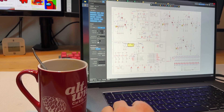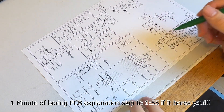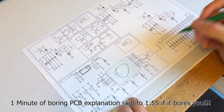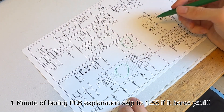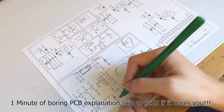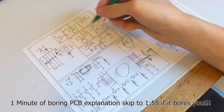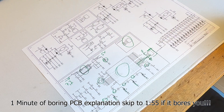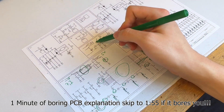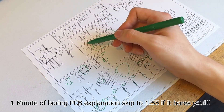It all started in Altium where I drew the schematics. They are separated into three pieces. The first one is the ATmega chip here, which powers the whole logic. Then of course a flashing connector, a trigger to power it, LEDs for each stage, the LDO to go from 7.2V of the batteries to a constant 5V, the reset button, the display, and the power button circuit — basically this one here — to just hold the power, and then the button itself.